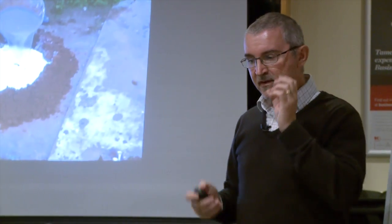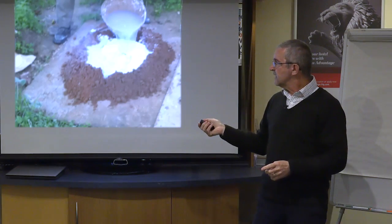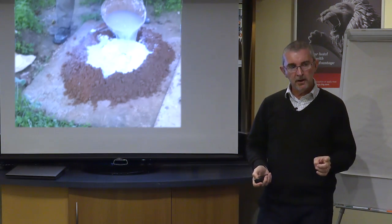But there is this other technique, which I'm going to explain to you now, which is the complete opposite. It's where you, much like on a modern building site, have your bell mixer, put your cement in, put your sand in, chuck a bucket of water in, mix it up into a mortar straight on the wall, and it's job done all in one day. The variation on that using lime is what we call a hot lime.